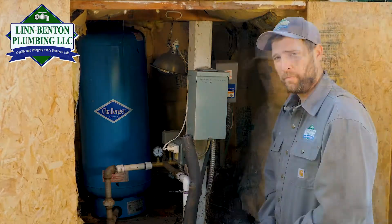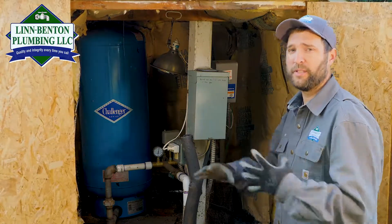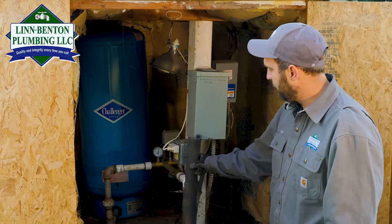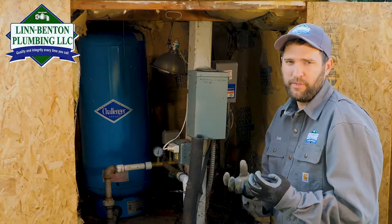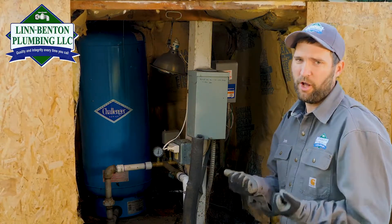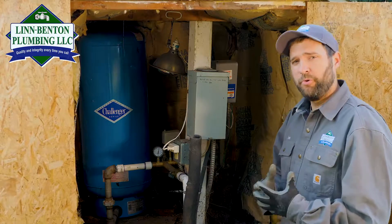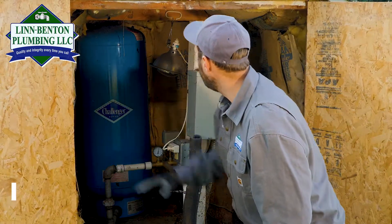The next thing I want to talk about is the insulation in the pump house and how we're going to protect the components from freezing. You can insulate the pipes — we have some insulation here on our outgoing pipe. The problem with just insulation is it only holds in the heat already in the pipe. If there's no movement and you have an extended cold snap, that heat is eventually going to be drawn out and your pipes will freeze, and when they unfreeze they will probably break. So insulation by itself is not always a great solution.